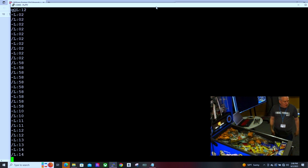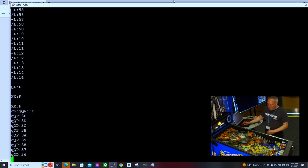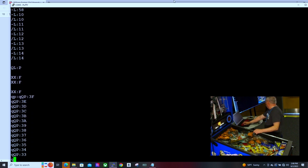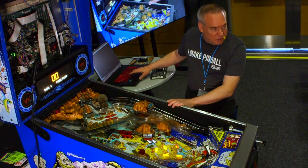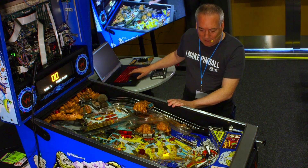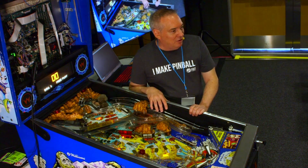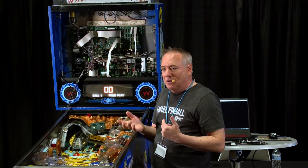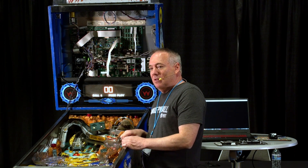Another asset the machine has is all of the switch matrix lamps, and there's another test you can run through on that. All the lights on the play field start to go — probably not the easiest to see on video. You can also show which rows and columns they're at by pressing the space bar. It takes about two hours to map out a game, writing down each switch and light. You can also use the manuals; we try to keep everything in the same order.